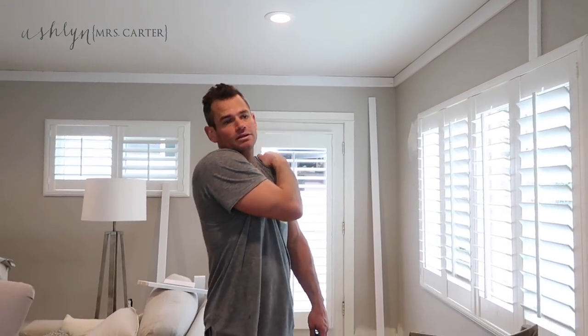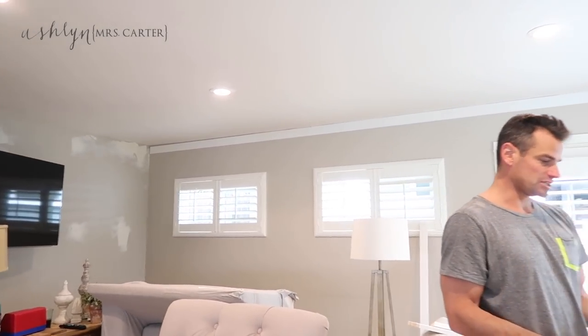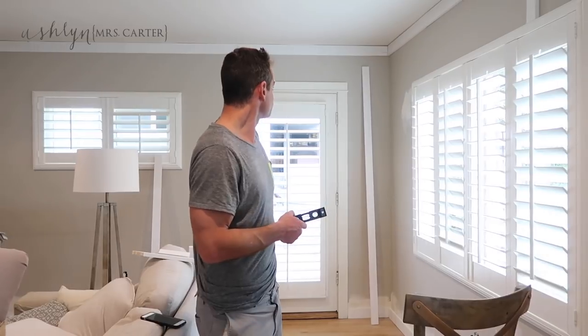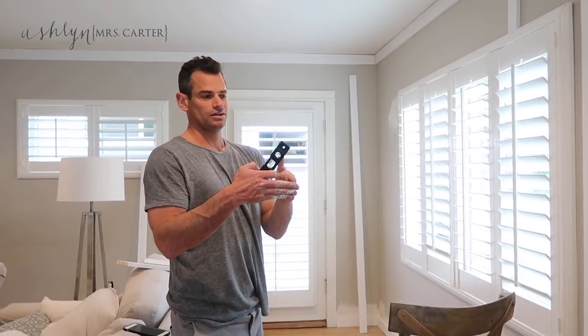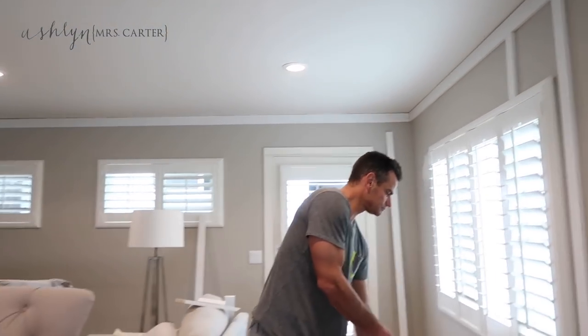The hardest part so far is that our ceilings are not perfectly level, so we've got gaps we have to fill — that was frustrating. We had to do a brand new baseboard to get the strips to be perfect and patch where the old baseboard was longer. Also, every corner is different with 45-degree angle cuts, so there's a lot of math to make sure the pieces join properly. But we're making good progress.